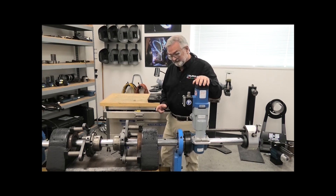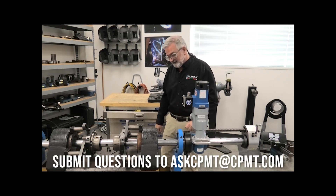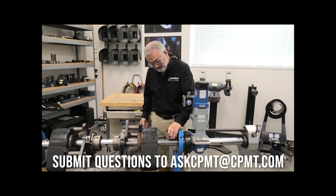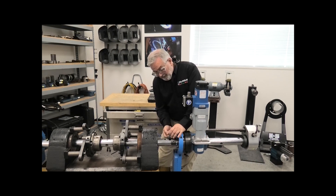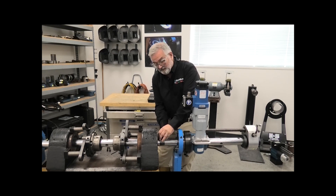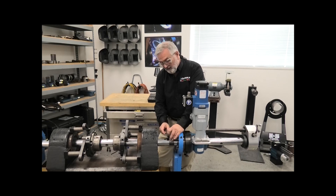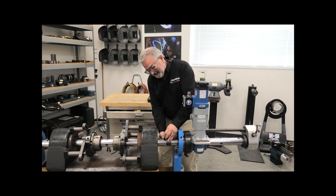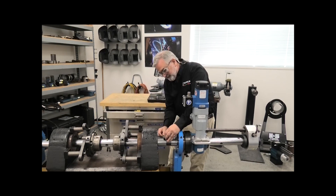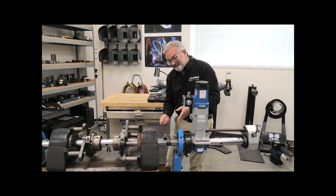Now I'm going to show you what I mentioned about how I set the tool bit and the relationship of the boring head to the tool bit. I only have half of it here — I can use a shorter tool, put it between the bar and the boring head, and move it anywhere along the bar. I don't have to necessarily have a tool slot. I can set the height of a shorter tool and reach my bore, or I can use a full-length tool that goes through the boring head as well as down inside the bar, then clamp the tool bit in the bar and make an adjustment to the boring head separate from the tool in the bar. Let's go ahead and put this on — I'll use a long tool bit for this first demonstration, then take it out and put in a shorter tool.